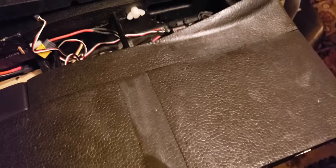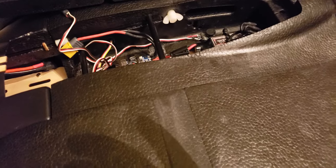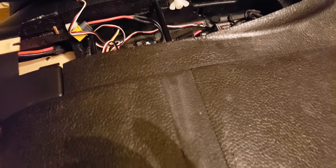What I ended up doing first was putting a 470µF capacitor on the ESC power wire tabs, trying to help with the flickering. Basically all that did was improve it by maybe 40% or so, so I thought I'm not going to put a bunch of capacitors all over this thing.